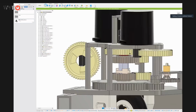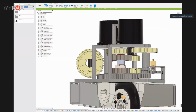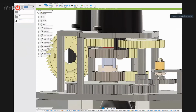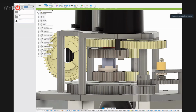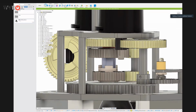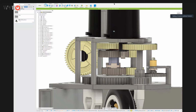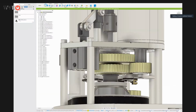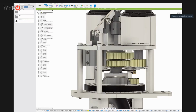And then the actual gear stack that would do the shifting was on kind of this intermediate shaft, which could have led to all kinds of problems. It was definitely not a perfect design, because you could have all sorts of axial loads on the shaft that we didn't want. So that was one of the major jumps that moved this from an idea to something that we actually really wanted to make.